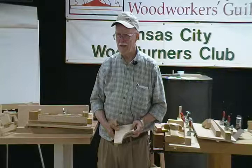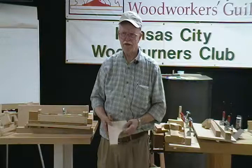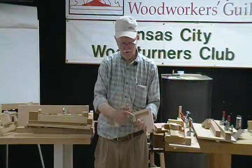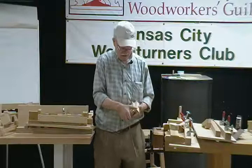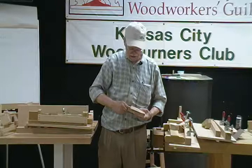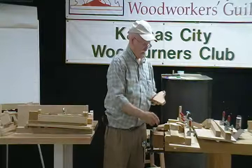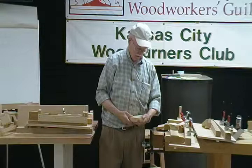What does the fence do? It establishes your relationship to the cut line. What's the cut line on a router? The tangent point to the bit. So this is the fence. But we also have to locate this in the proper attitude, so we've got three more fences back here. For the first operation, we take our blank, put it in here, take a pencil and mark right there. Then go to the bandsaw and put the waste out about an eighth of an inch outside that line, and put this back in here.